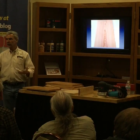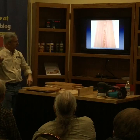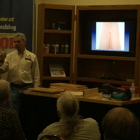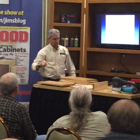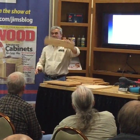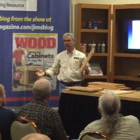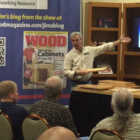If you're doing a project with a lot of doors on it, that's some way to put some straight grain along with some of that cathedral. While I'm thinking of it too, whenever you're doing a project with cathedral grain, make sure it's always pointing up. People psychologically feel better when the grain is pointing up. Think stock market, not down. And the other worst part is, I mean, this is bad. This is much better, but this is much worse, where there is no semblance. They're not all facing up. They're not all facing down. They're everywhere. You'll have a stroke looking at something with that kind of thing. So when you're doing these, just make sure that the grain is always facing up.